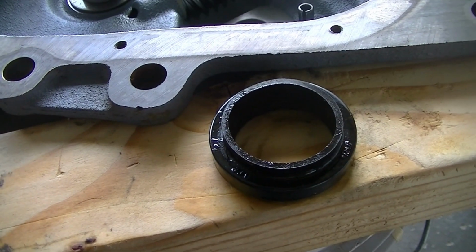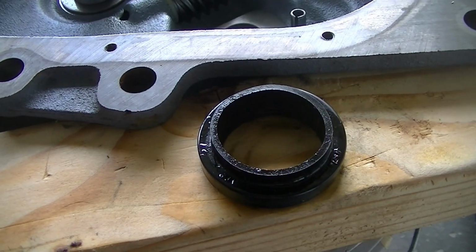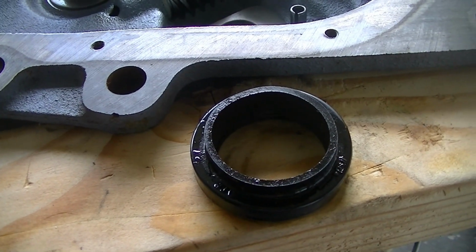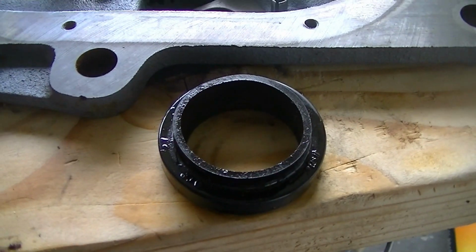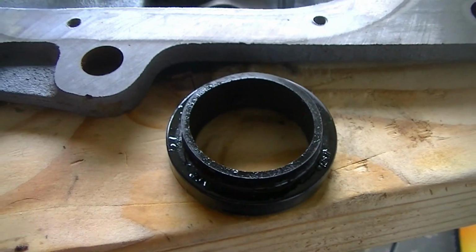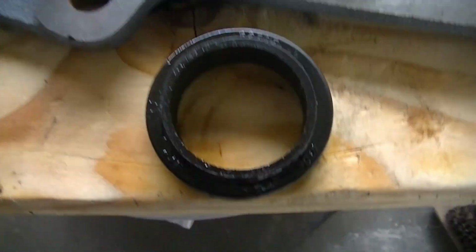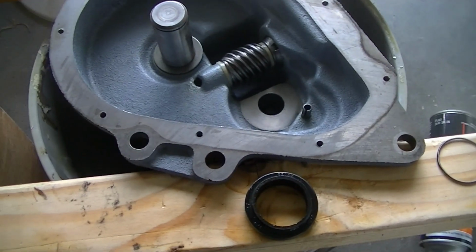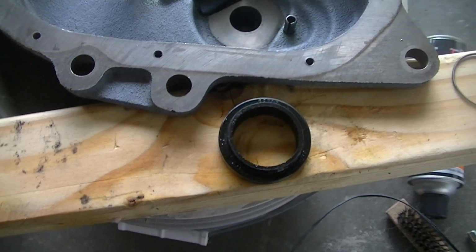You know, I posted this on automaticwasher.org, and people are saying there that this seal is most likely the reason why it's slung out oil. And I think Sharky626 also made a comment a while back on one of my older videos of this machine, saying the same thing, that it's this clutch seal that's probably gone bad. So I'm gonna order a new one of those and put that in, and hopefully that takes care of the oil slinging issue. So I'll see what I can find for that and get one of those ordered up.